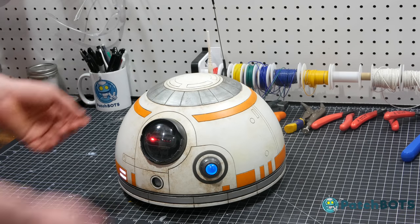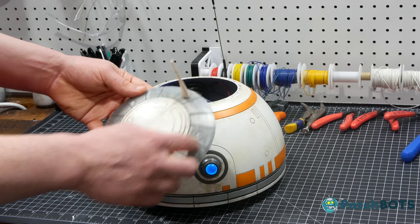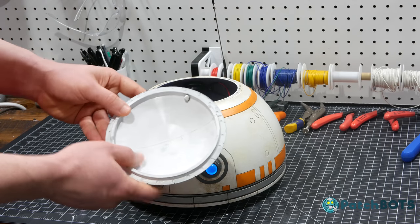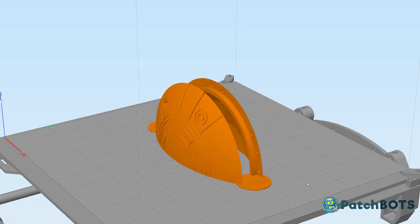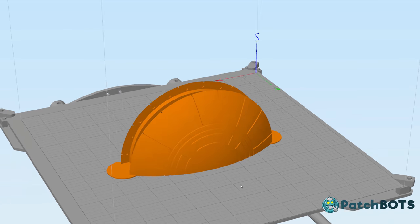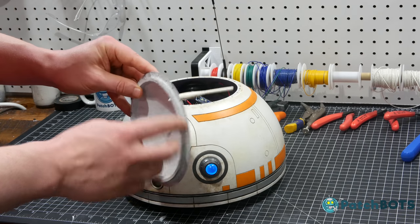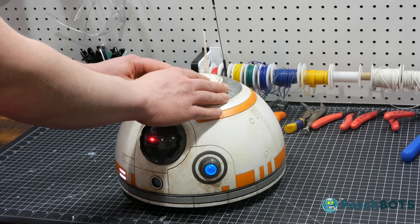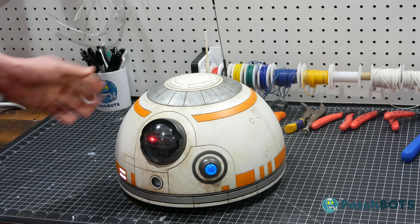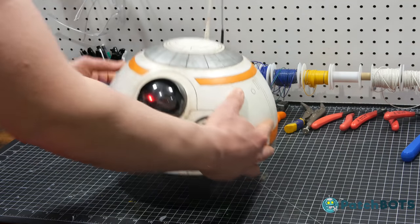The first piece that I modified was the top of the dome. This used to be two pieces — the pie panels and the dome top. I combined those two, hollowed out the inside, and split it down the middle so it could print side by side on the print bed. These can be printed with no supports and the lightest infill possible. I also added in a rim so that when you attach it back to the dome, it attaches with a push fit rather than magnets, giving it a little bit of side-to-side stability.